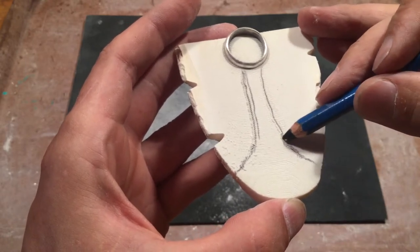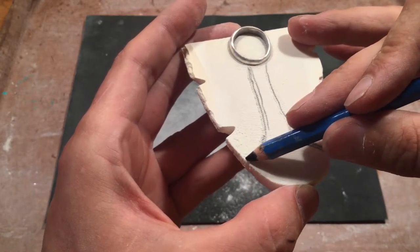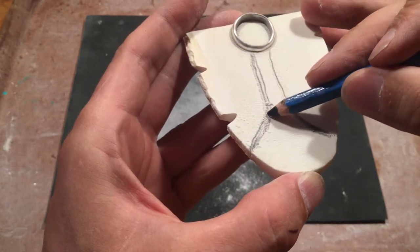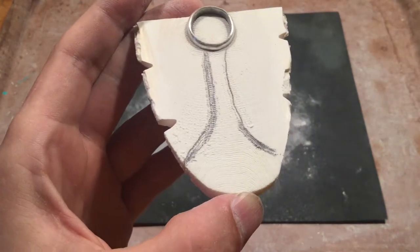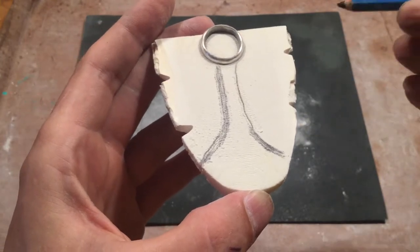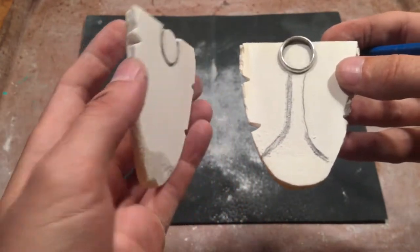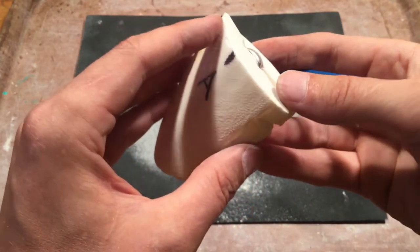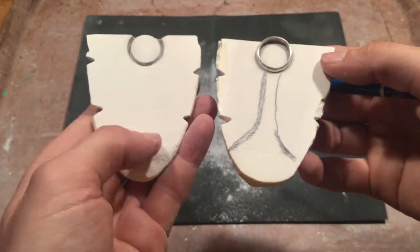Make as big a target as you want — how big do you want to make this? Remember, you're going to have a two to three foot handle on your crucible with a blowtorch, everything is going to be on fire, and you just want to determine: if I can get a bigger target to pour into, why wouldn't I? Do the same thing for the opposite side as well, making sure that Part B and Part A both have a button carved in and a clean pour gate.